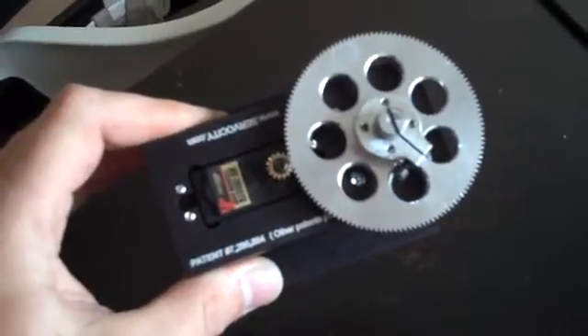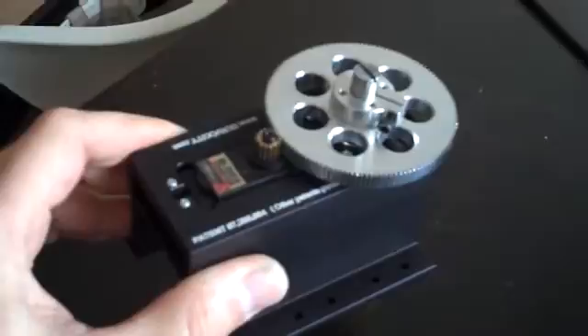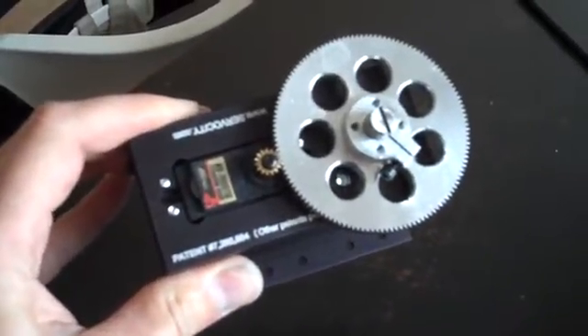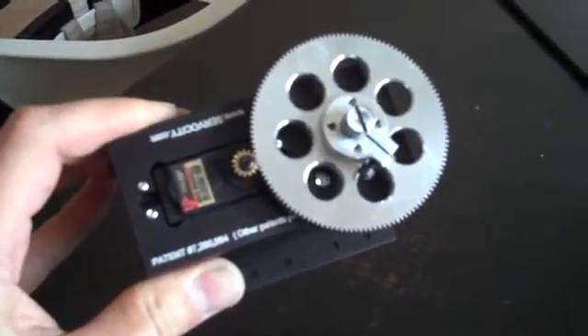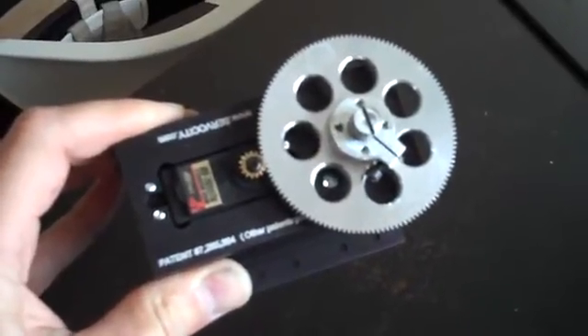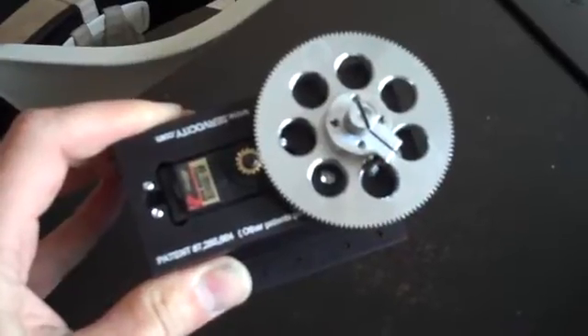Essentially, what you have to do is open up the top part of the servo and remove the stock pin. Unfortunately, in the 7955 it's set hard into the titanium gearing, so the only option was to grind it down. That was frightening because you can't damage the gears in any way, but you have to grind the stock pin flat — which is what I did.